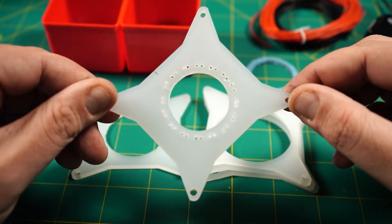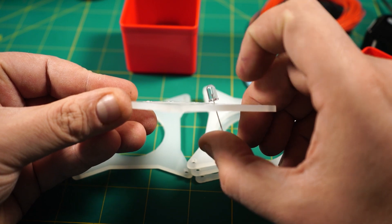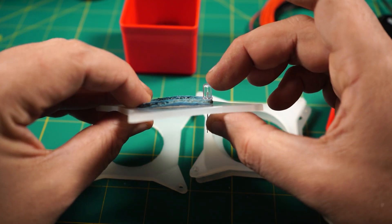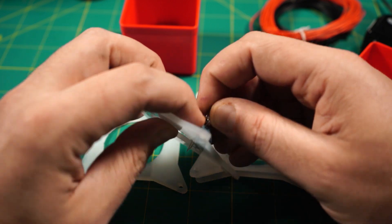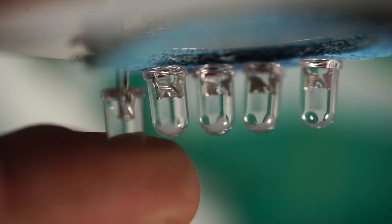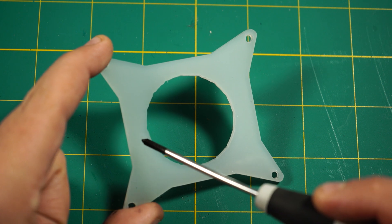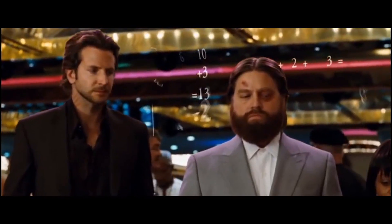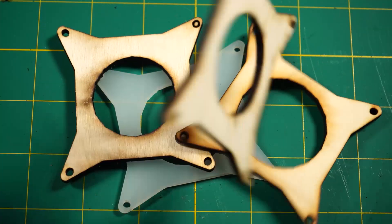I have my pieces cut out and you may see what I'm going for. In my design I want the LEDs to point more or less directly into the small mirror, so we need to bend the legs of the LEDs to a certain angle. The cloth gives us distance between the LED casing and the acrylic sheet, and at the same time it is soft and squishes together when bending the LED legs in place without too much resistance. The upper ring is a bit smaller — that's not a failure but part of the design. It pushes the LEDs at a calculated angle — well, I tried it out in six tries until I found an angle that works.